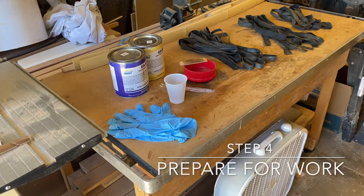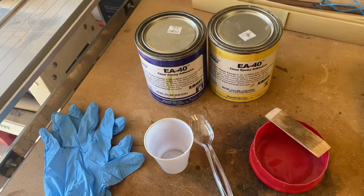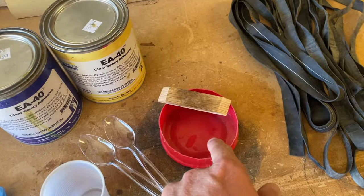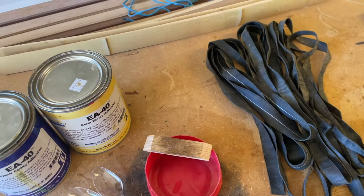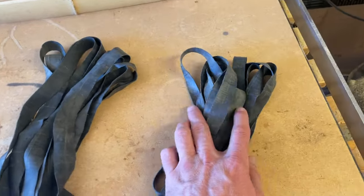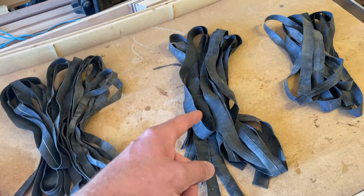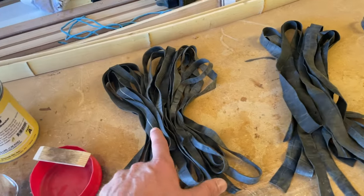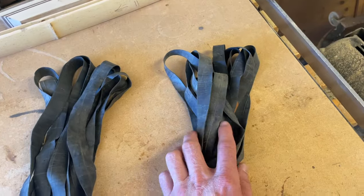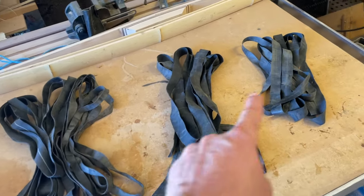Step number four: prepare your work. Got our glue at the ready, gloves ready to go to protect our hands from the epoxy, mixing materials - a cup and some spoons, one for each part of the epoxy - a spreader, a place to put the spreader that keeps it isolated and not sticking on everything when you're trying to work. Long-length rubber bands, very short-length rubber bands, and medium-length rubber bands. The short lengths handle the grip section and any small areas needing additional clamping pressure. The long lengths will run the entire length of a limb and back. The medium lengths are what we use to put it down on the form once everything is glued together and ready to take shape.